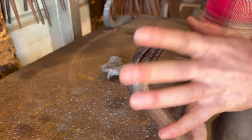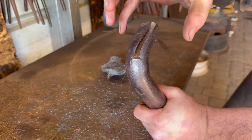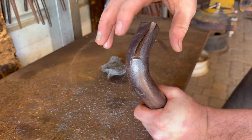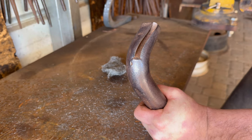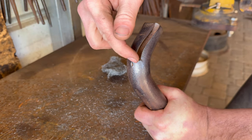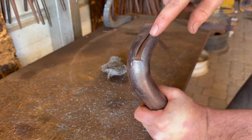So let me give you, a keyway is pretty much a slot that a hub went on here that also had a keyway. And then you hammer in a chunk of steel here that disallows it from going like this. This used to be straight in line here. They bent this old axle this way at a 90 degree angle. And that's what that curve was. I was so curious, and I feel so good to have some answers.